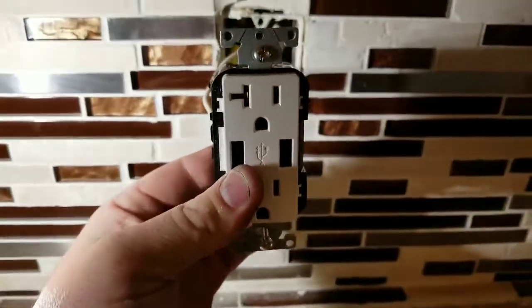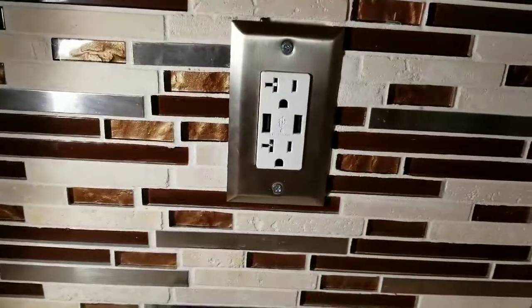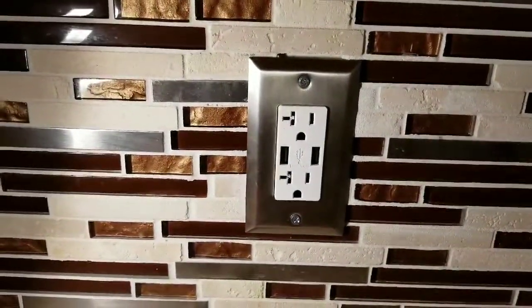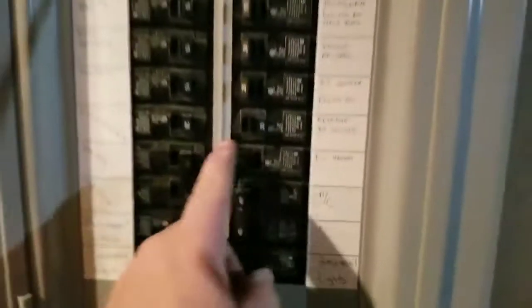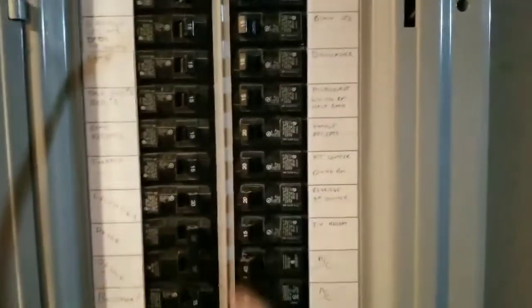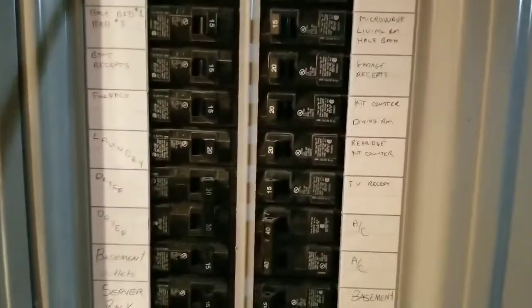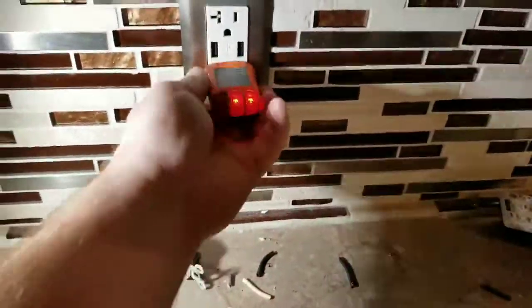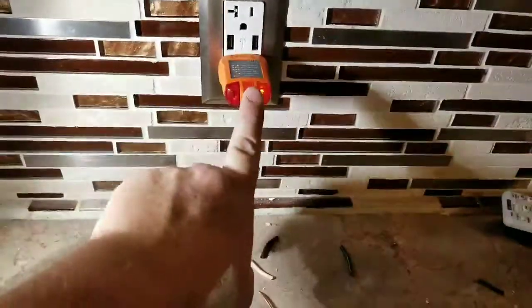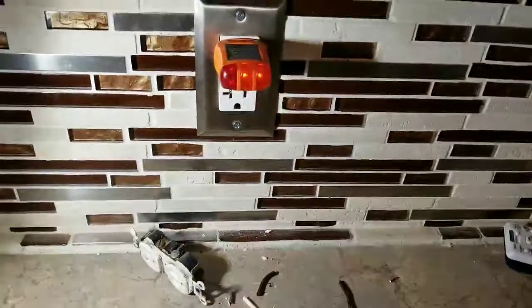Now I'm just going to push this back, tighten it up, and then we'll turn the breaker on. Reinstall with the two screws in the back, and then these two screws right here with the new wall plate go right into the outlet at the designated spot. Now let's go turn the breaker on. Find your breaker — right there — flip it on. If you flip it on and it automatically pops, obviously turn it off and go find out what you messed up. We're going to take our little electrical outlet tester, plug it in — boom, it passes. You can see — it's good, it's grounded, hot's hot, neutral's neutral. We're good to go.